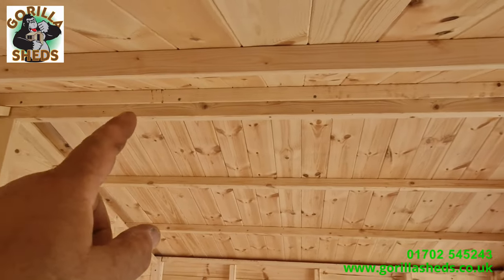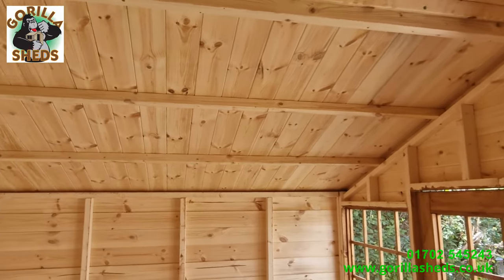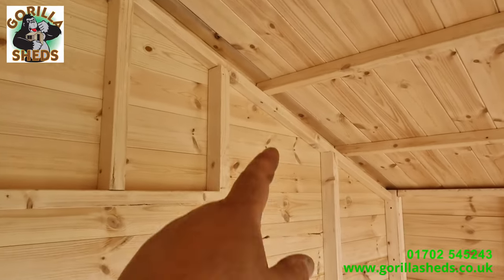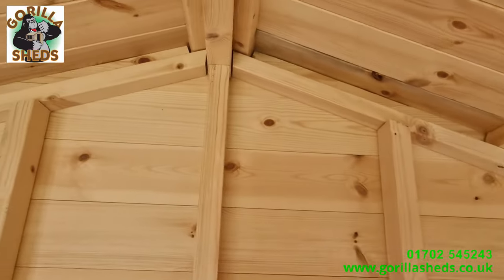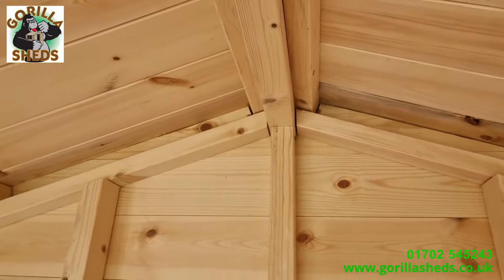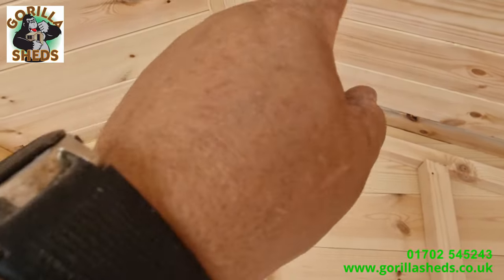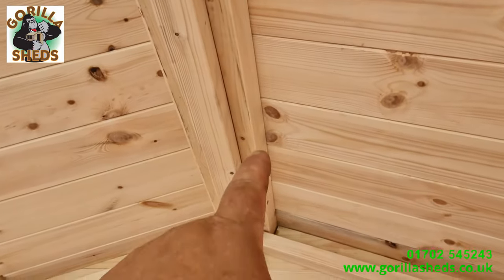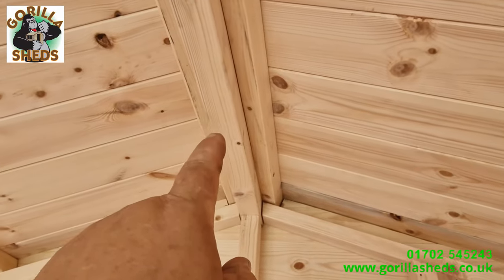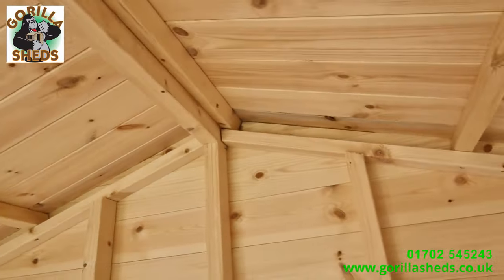Through the middle of this roof there is a 4x2, and the two halves of the roof clip onto that. You can see the ends of the timbers are supported there, and at the top the 4x2 is supporting the roof. The planks overlap that 4x2 — they're actually nailed into this beam here but also resting on that 4x2. So it's a very, very solid roof.